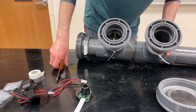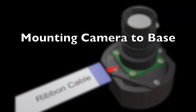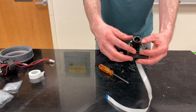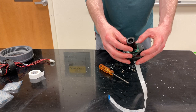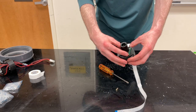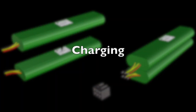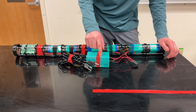This base mount is the same base mount used for both the camera and the LEDs. I loosen it a little more and push it down. When this is mounted and ready for deployment inside a pipe it's very difficult to screw these in, so I get everything ready and mount it inside the camera tube using these small screws to screw it in place.